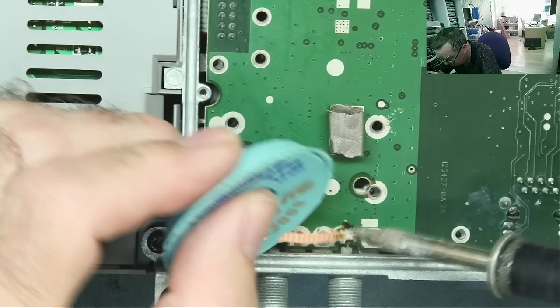So this is a spectrum analyzer. And I'm just thinking, I've stuck a bit of wire into the, well, it's actually a resistor, but a bit of wire into there. That's the RF output. I'll put the antenna somewhere in that general direction. And if I switch this on and we see a spike, I think we can say that I'm touching the RF. And you see this spike here, this one? That's saying it's at 536 megahertz here. Okay, can you see it? 536, and this is set to 538. So I would say, yeah, 539. So I'd say this is working. Switch it off. Yeah, that's gone away. So although I don't have a TV, I know that it's outputting RF now in the right frequency.